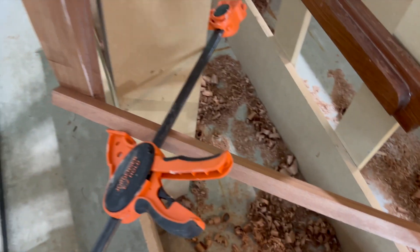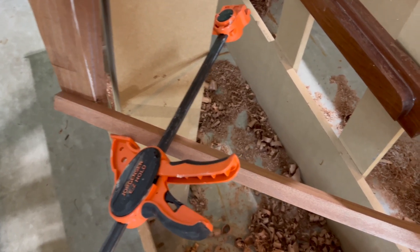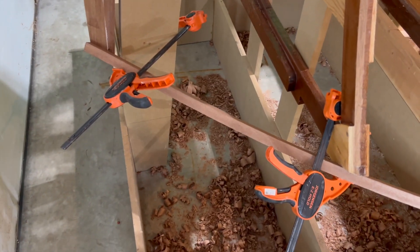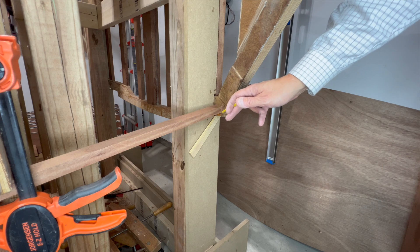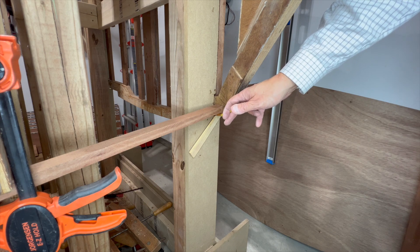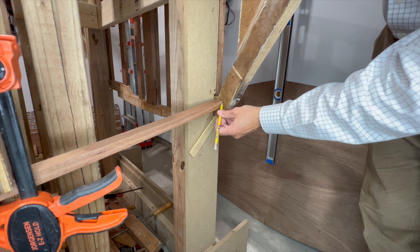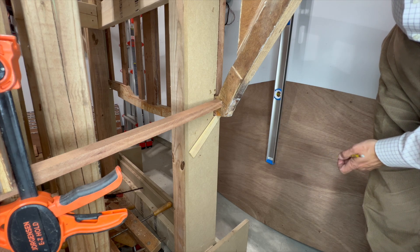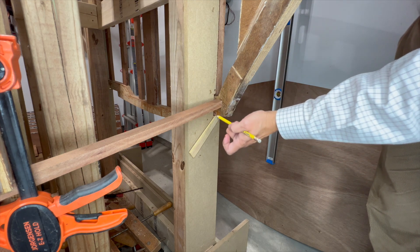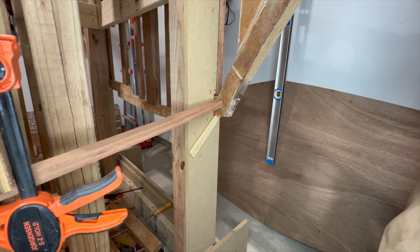You can see here — not only does it have to bend in, I have to twist it to line up to the stem. I'm not exactly sure how I'm going to do all this yet. When I look at the transom, I'm not sure I want to cut all that out and leave so little. I'm actually considering butting the first board up in here and then cutting around it — I could butt that one up, cut off less of the transom, and put the other three through it.